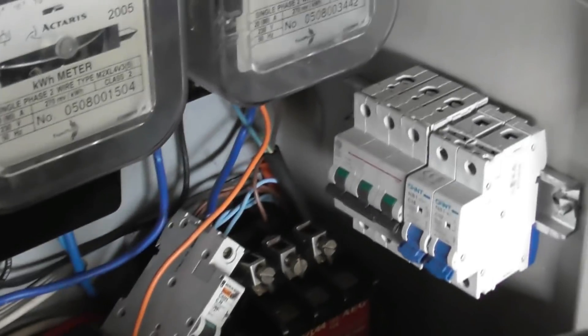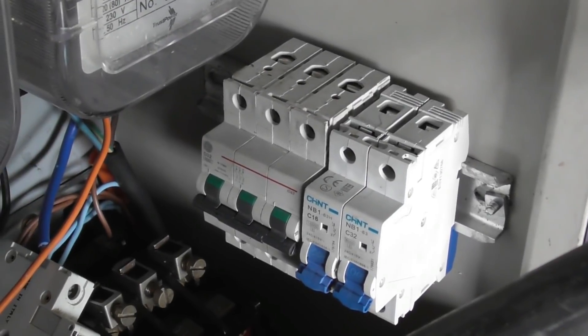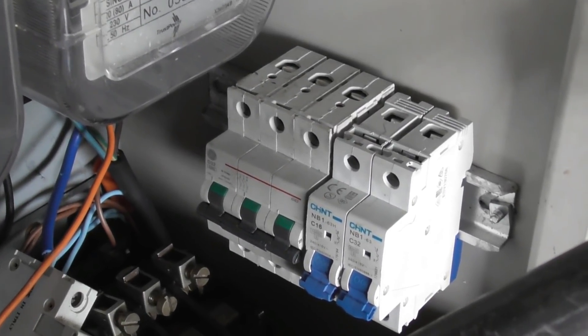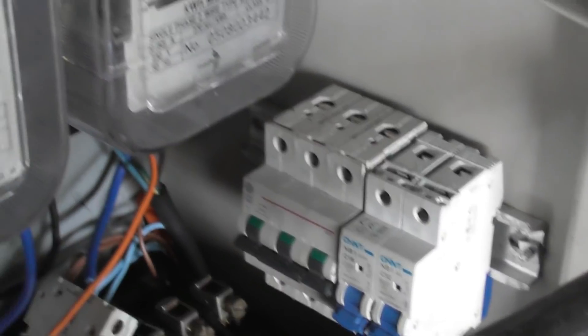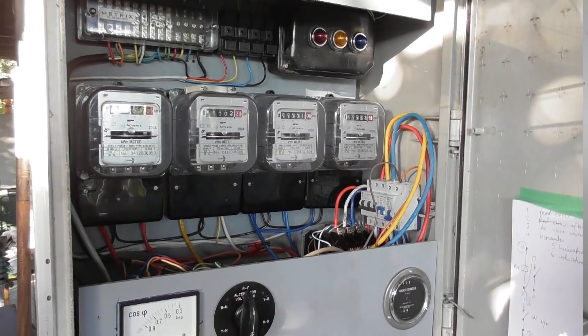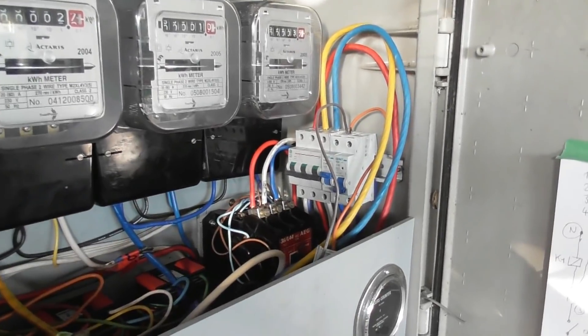I was pondering fitting a next-up box, but now I've decided to put some circuit breakers on the side - D32 for the house three-phase, and then a couple of 16 and maybe 32 auxiliary circuits for the time being. I've got the cable in, tidied up a little bit, circuit breakers fitted, and insulation tested.